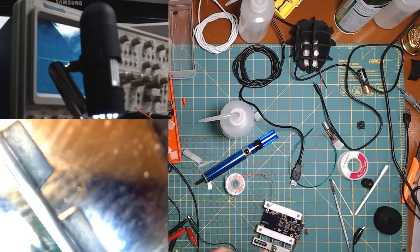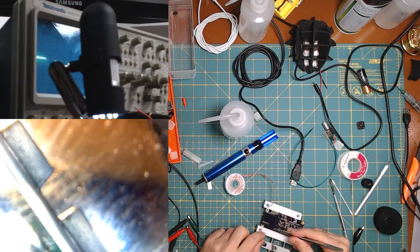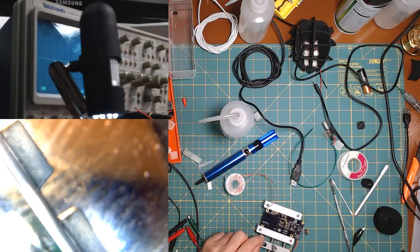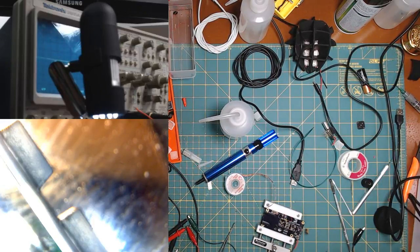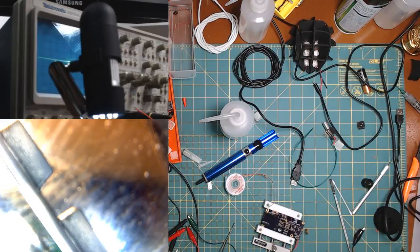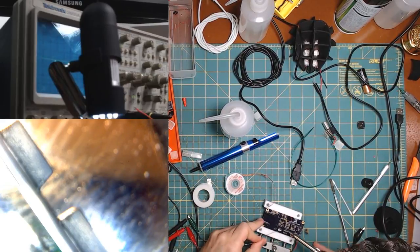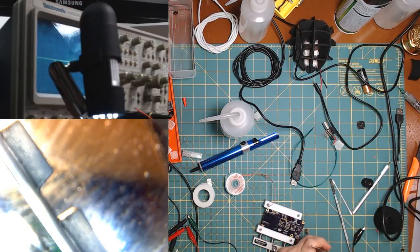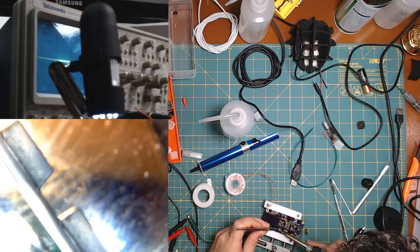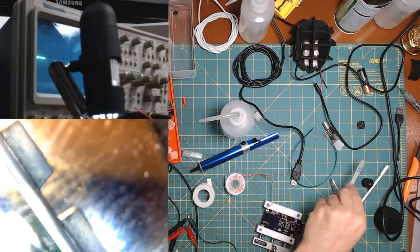And let's grab our little guy. Put it back on here. Okay. Nope, it's upside down. It's like, oh, that's weird. Pins don't go on the board. All right. There, so this one we'll do old-fashioned way. I'll use some solder, which I have right here. Some solder on one pad there, and then grab my component, solder one pad in, and then do the others.